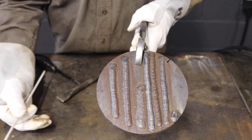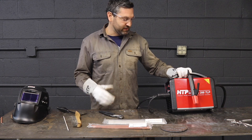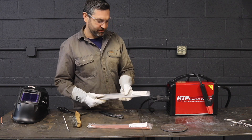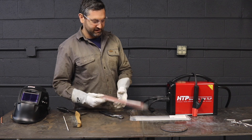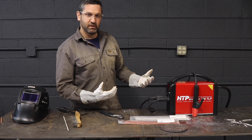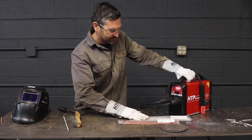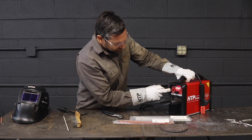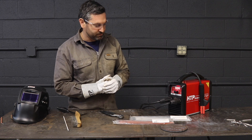It's a great F4 7018 rod to use. Today we ran some stick welding with the HTP InverArc 200 TLP. We ran both the HTP 7018 3/32 inch rod and the HTP 6010 1/8 inch rod. Really just an impressive machine. It's got a couple different settings — a smoother, softer arc setting for your 7018s, a cellulosic setting for 6010s and 11s. And I was able to mess around a little bit with the pulse on stick, which is kind of crazy to believe.